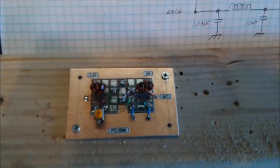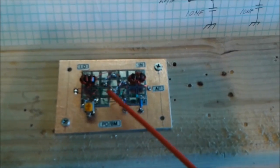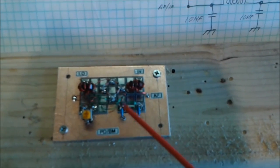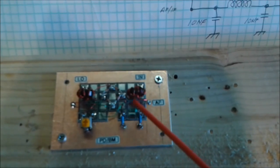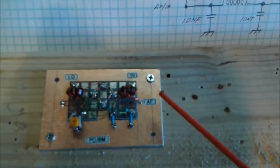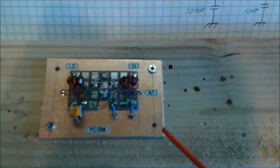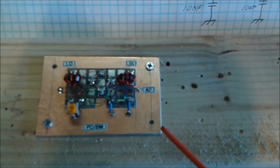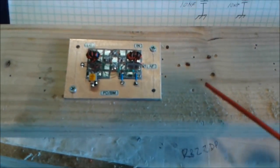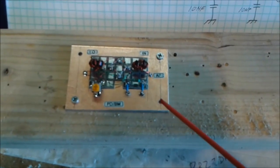The construction was done on a piece of 2 by 3 inch PC board. We use the ME pads — ME squares — from W1REX, and this is really slick. I just glued them down, figured out my circuit and how many squares I needed, put it to the board, and soldered everything. The outside is ground. I drilled four holes in the corners previously because ultimately this is going to be screwed down to a breadboard. Having these holes made in advance, I have this on a chunk of plywood so it steadies everything while doing the soldering work and nothing's moving around, so you get real nice clean solder joints.